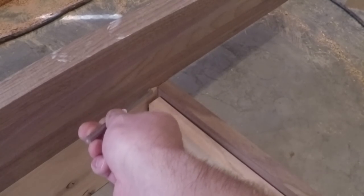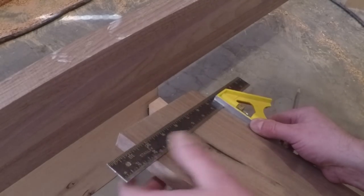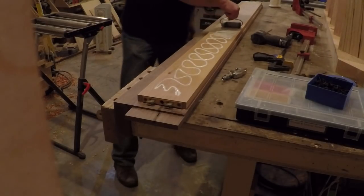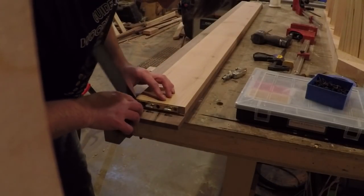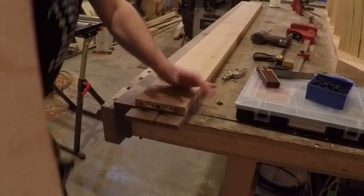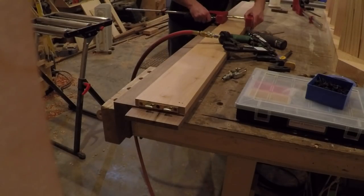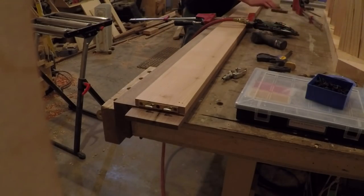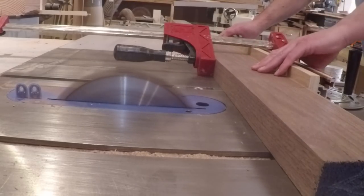I held the piece in place and laid out for the notch. I spread some glue on the support rail and aligned it to the edge of the notch for a tight fit when the headboard was installed. Once I got it all lined up I just tacked it in place with a brad nail while I lined up the other end. There was a slight bow in the center so I pulled it in place with a clamp and put a few brads in it until the glue dried. Then I milled up some eight-quarter walnut for the platform frame going around the mattress and cut it to length using the same clamping method on the miter gauge.